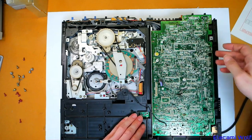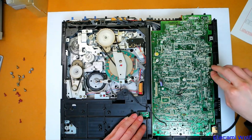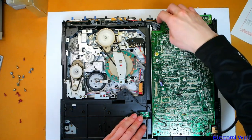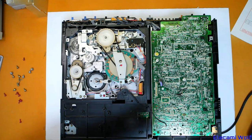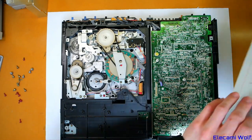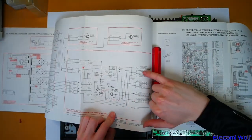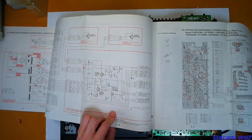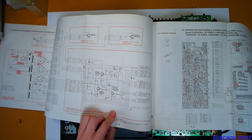To prove that, a way you can prove it is by just running this gear so that it's not in its stop position, and then switch on the power and see — will it return to the stop position? Because as part of turning on, the VCR will get itself back into its normal resting stop position. If we set that to somewhere that's not the stop position, turn on the power — and it runs, like it would, to reset itself back to the stop position. So that proves that the main part of the system, the servo section and control section, is functioning.